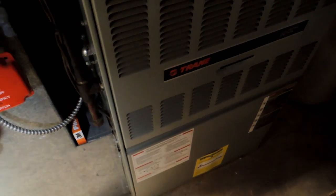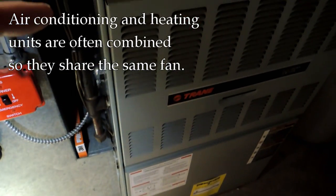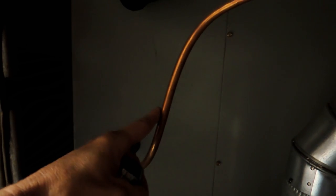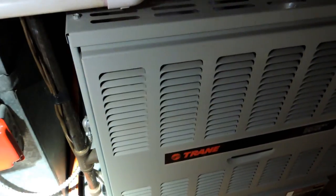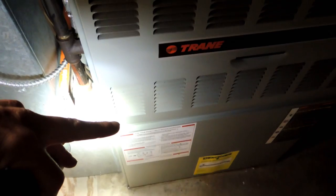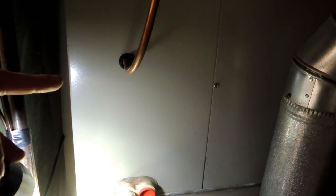Here on this system, you have a heating unit located right on the floor in a basement, and on top of that heating unit is the evaporator. You can see the cooling lines running in here. The system uses the fan from the heating unit for air conditioning as well. That fan is located down on the bottom, forcing air through the system. In here are the cooling fins of the evaporator, and as that air goes over those fins, it cools down.